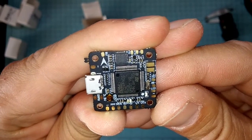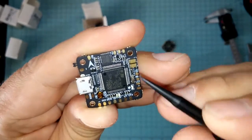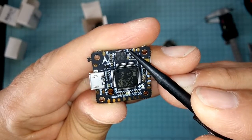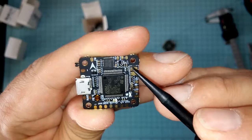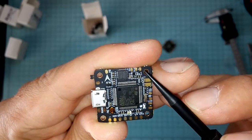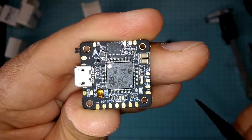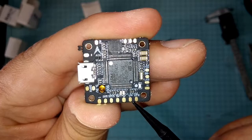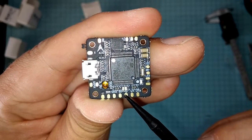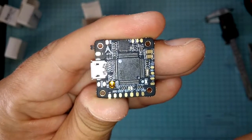You can see in the top right-hand corner it's got video in, 5-volt, and ground right here. I read a review where a guy said this was 15 volts and this was negative, and he fried two VTXs. I don't see how that's possible, but I will test this before I hook everything up — I'll go through all the voltages and verify for you. So it should be okay. Over here is your VTX — he said this one was 15 volts, my mistake. So your voltage here should be 5-volt, negative, and your VTX signal.